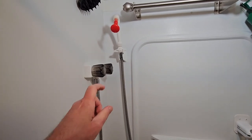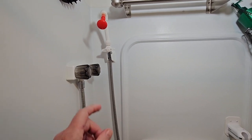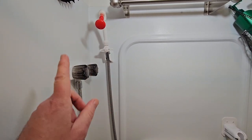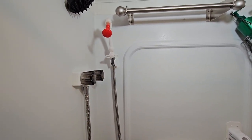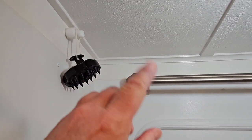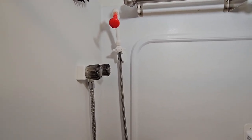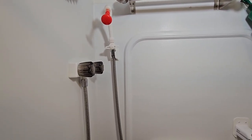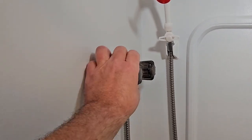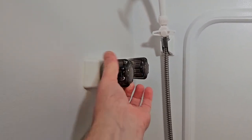While it does have a hot and a cold, neither one of those regulate hot or cold. They're just both open to let water flow because I only have a small air hole up here at the top that lets air into the gravity tank behind this wall. I preheat the water to whatever temperature I'm going to be showering in, so these just both stay open to keep the water flow as much as I can get it.